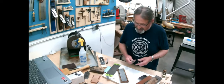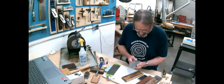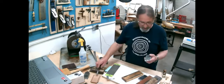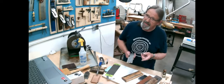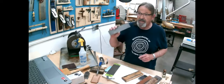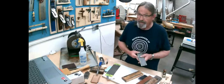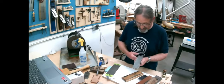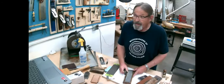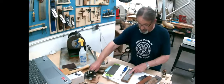Question: how do you flatten your ceramic stones? I have never had to flatten mine. I checked this last night — I've had it for two or three years, and there are still machine marks there from when it was made. I use this on my bench all the time. The absolute no-no: never use sandpaper on a ceramic stone — it would ruin it, you might as well throw it away. I've had mine for years and never needed to flatten it. I keep it on the bench all the time and just keep my chisels touched up.